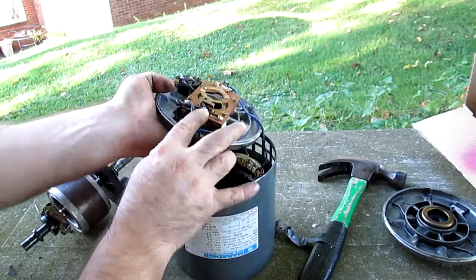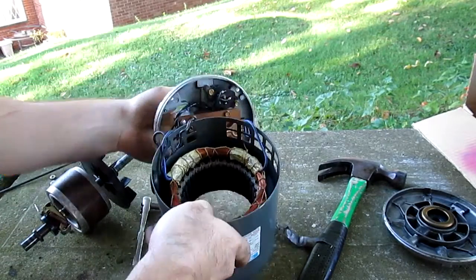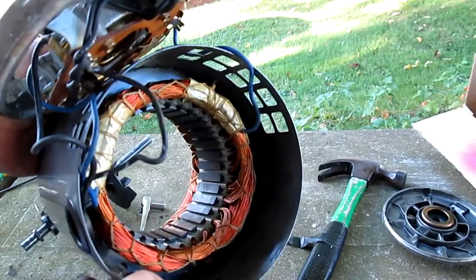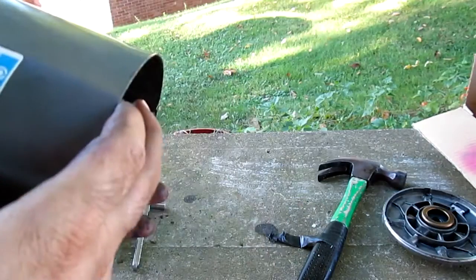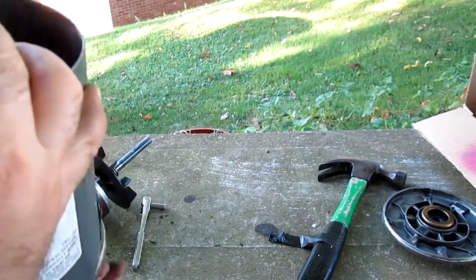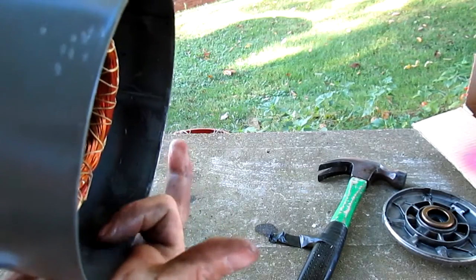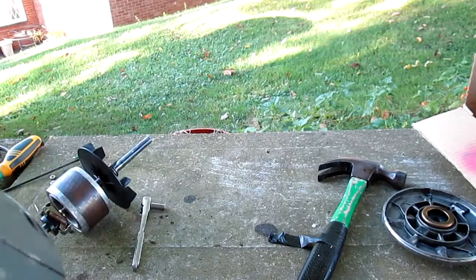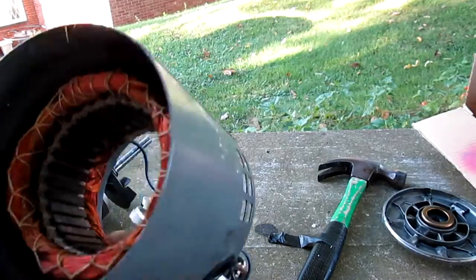So the motor heated up a little bit. You can see this is burnt — so I thought, okay, maybe a bad contact. If you look in this motor, the windings are fairly healthy. You can tell the start windings ran warm, but they're not burnt. Or I don't trust the information on it because it's been messed with. Look in the front and see that black residue — some of that's dirt. And I looked and I looked and I looked and just couldn't figure out why this motor had no torque.